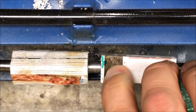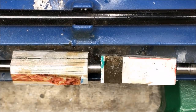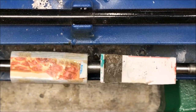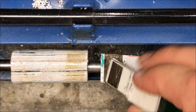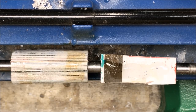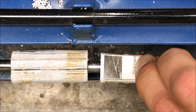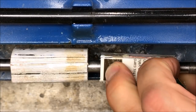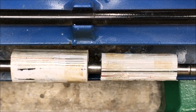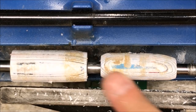I'm going to put a little bit on here and shoot a little activator on the other half, then try to drop it right into place. Get some more activator on there. Let me back off the tail stock and make sure I'm not stuck to my bushings — I'm not, so that's a good sign. I've got the next piece that goes on there, and you can see where I caught right there as I was coming across. I'm going to get these off the lathe, go over to the sander — I cleaned up the front blank and rounded out the back blank a little bit as well. We're going to give this another spin.